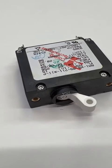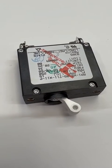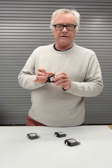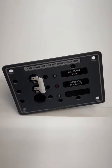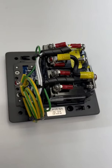The first one I have here is what's known as an A-frame toggle breaker. The A-frame breakers are smaller. They have a round cutout and on the underside they have screw connections. These come in sizes up to 50 amps. They can be used for AC and DC and they come in double pole as well. Here's an example of one installed in a panel — this is a double pole breaker and at the back you see the screw terminals.